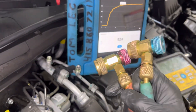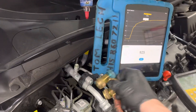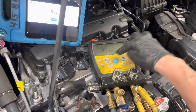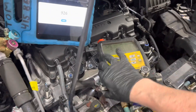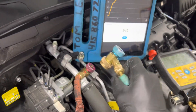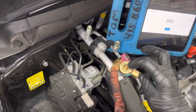I hope this answers your question about whether these leak when disconnected — they don't. If you have any doubts that one is leaking, repeat the test: turn one valve off and read the micron level of just that one line. Then close that one, open the other, and repeat the test to find out which one is leaking.